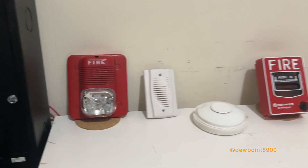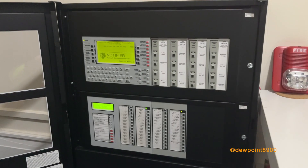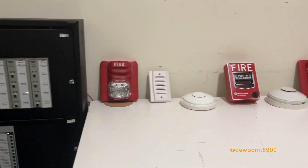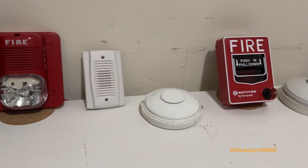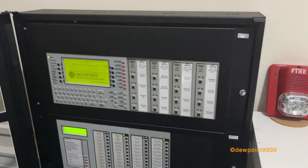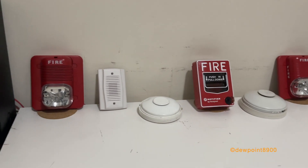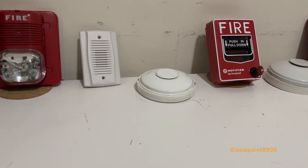There are also general alarm signals in the hallways. In a high-rise hotel or apartment building, it may be impractical to evacuate the entire building over a single alarm. Instead, a local sounder might activate in the room when the alarm occurs, and authorized personnel can investigate. On a smaller scale, this could be simplified using selective signaling of horns and strobes. For this demo, the heat detectors are individual sensors in the apartment units, and the MHW is the apartment unit's local sounder. If either heat detector activates, the mini horn will sound and the panel will indicate the alarm on the various displays. If a second heat detector activates or a general alarm signal like the pull station is activated, then the building undergoes a full general evacuation and the Spectralert Classic signals will also activate. Let's begin by activating this heat detector, which will activate this mini horn.